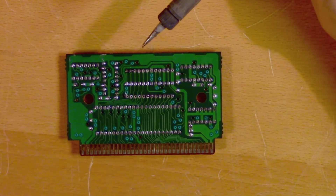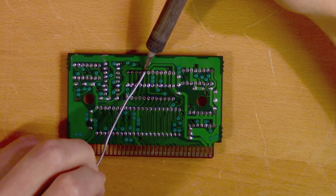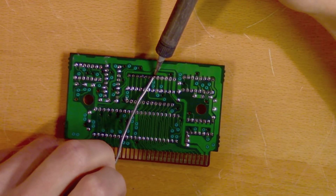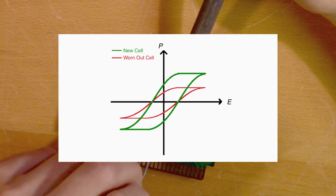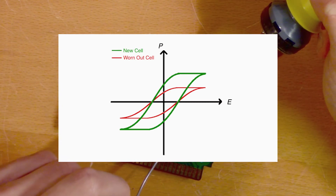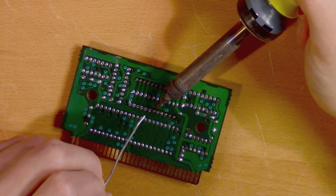Now we arrive at my first contradiction. The FE RAM does actually take damage during the read and write process. As it is used, charged effect buildup occurs due to ion diffusion and other submolecular effects, and will cause ferroelectric fatigue. This means that the charge difference between the 1 and the 0 state will eventually be too small to distinguish from one another. So why am I not satisfied with this explanation? The FE RAM breaks when using it, by design — so is it just a crappy design?